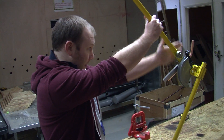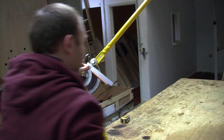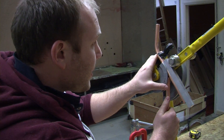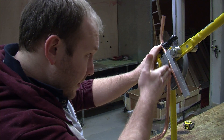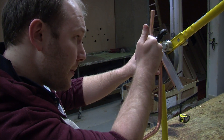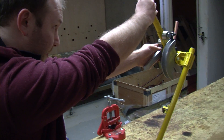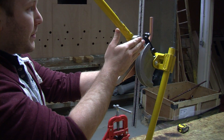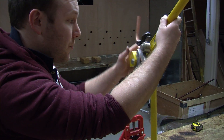Put the pipe back into the bending machine pointing straight up, and put a piece of pipe in to symbolise almost where you're going to pull your pipe around. This mark that you've made here should be running down tight to the outside of this pipe. Check that the pipe is running straight up. If it's pushed off to one side or another at this point, you should straighten it up. If you do move this pipe at this point, always, always recheck this mark.